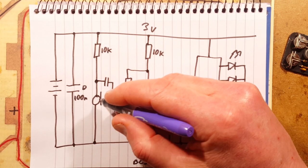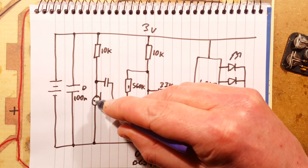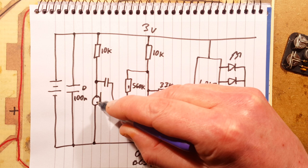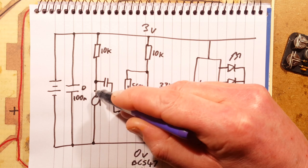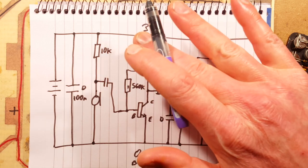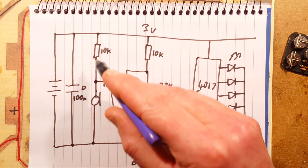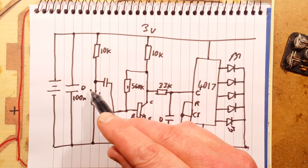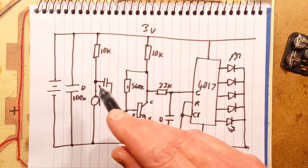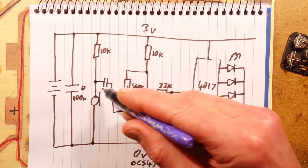It changes the capacitance, and that results in a signal that is amplified inside that by a FET, field effect transistor, which is super sensitive. And what that does is it means that the amount of current this will pass varies. So effectively, it looks like a resistor that varies up and down with the deflection of that diaphragm. Because you've got a resistor there and this varying resistor here, the voltage here wavers up and down. And that is being coupled through this capacitor. The capacitor only allows undulating signals through. It won't allow DC to pass directly through it. It only couples that AC.